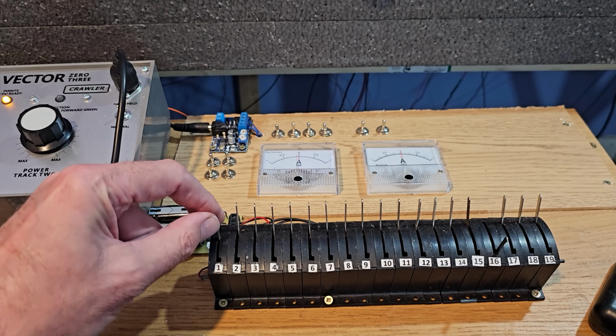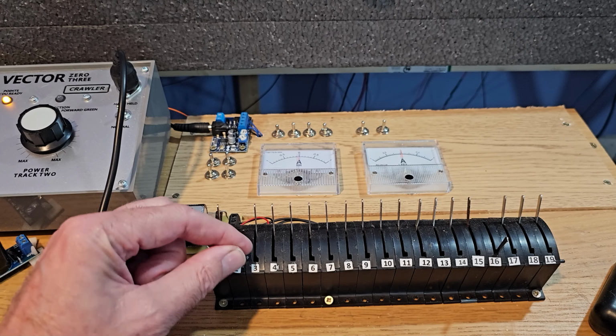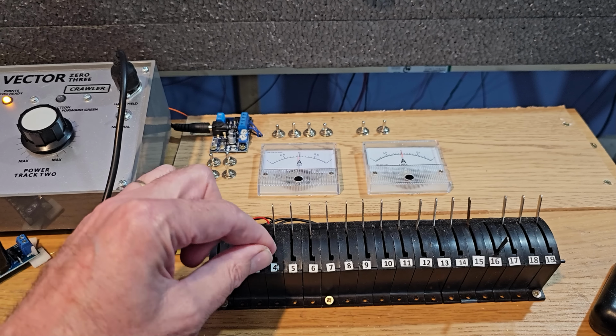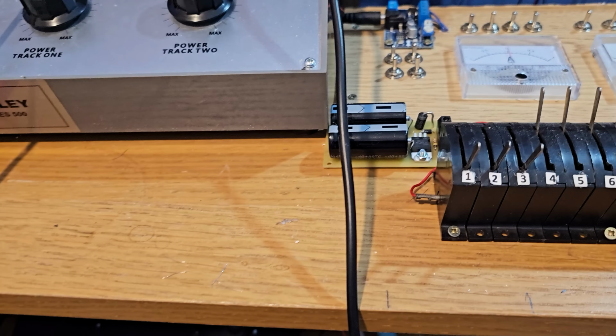You do have to move the lever slowly, but it does change the points, and they don't make a loud buzz, and they don't cause the locomotive to pause. The Archie Education one has a 12 volt CDU, whereas the Gauge Master one can take 24 volts. So I've connected it up to a 21 volt power supply at the moment. I'll get hold of a 24 volt one at some point, but it seems to work fine on 21 volts. But I think that makes a big difference, just a bit more oomph.